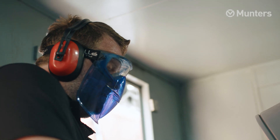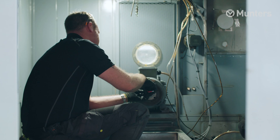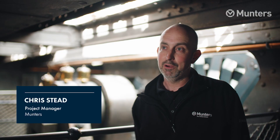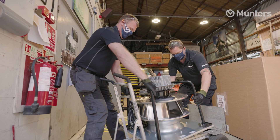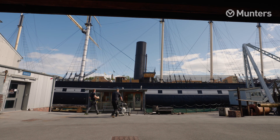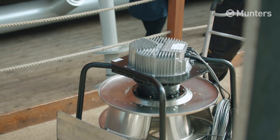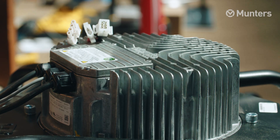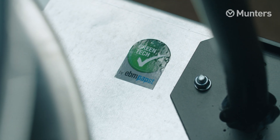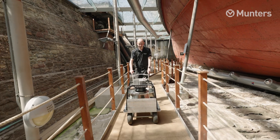There are two AHUs looking after SS Great Britain. The one we're working on is the dry dock AHU — currently installed with an AC belt-driven fan. We're going to take that out and put three EC electronically commutated fans in. Due to the layout, it's now impossible to remove the AHU as a whole unit, so we designed a solution to bring it in flat-packed or in component form, remove the old technology, insert the new, and then recommission the unit.